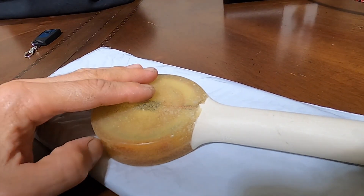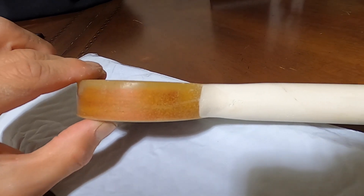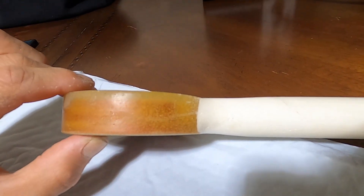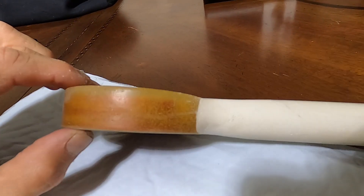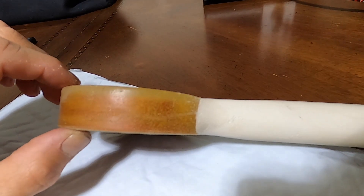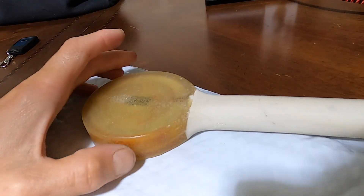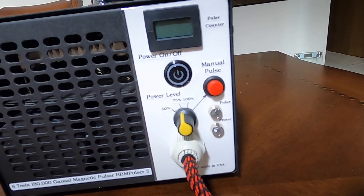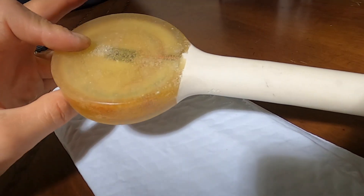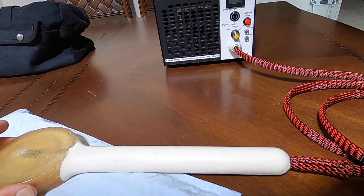The result of this is that I got the coil to be very quiet. When it pulses 8 Tesla it's quieter than my 4 Tesla fourth generation model. It's so quiet that I can place it over my ear and hear the clicks, but it's not going to make my ear ring like the other one would. This is a good advantage — especially on lower powers like 50%, when it releases 4 Tesla pulses it's really quiet, you can barely hear the click.